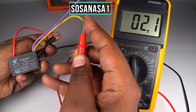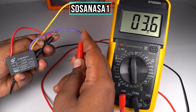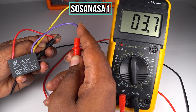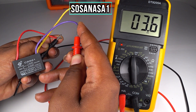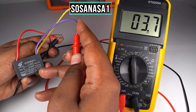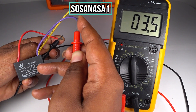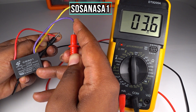Now let's test the other capacitor — the red cable with the purple cable — and watch the multimeter screen. It reads 3.6 microfarads. In this case, if the number on the multimeter screen is higher than the number on the capacitor, this capacitor has a problem. It is not in good condition because the measured value is not the same as, or near, the labeled value — the difference is too big, and that is not normal.